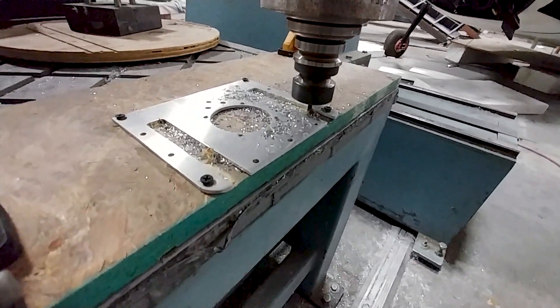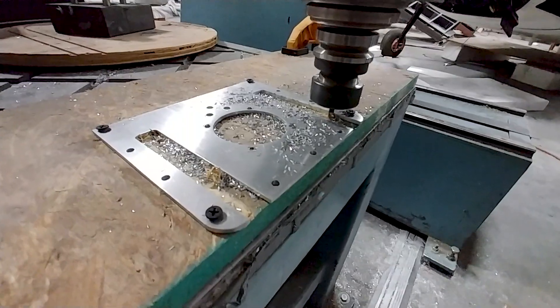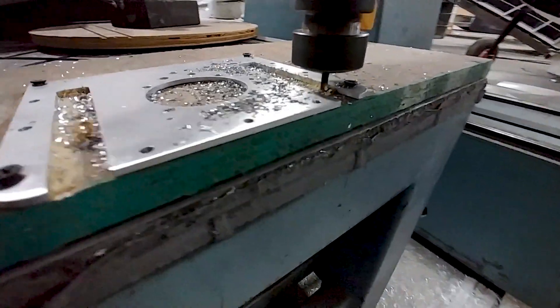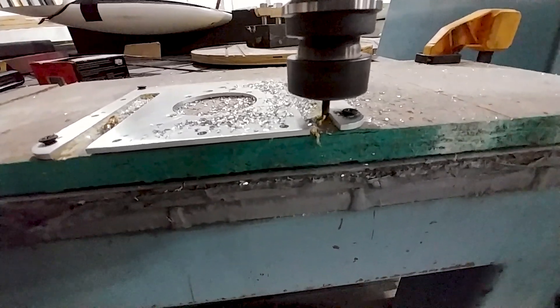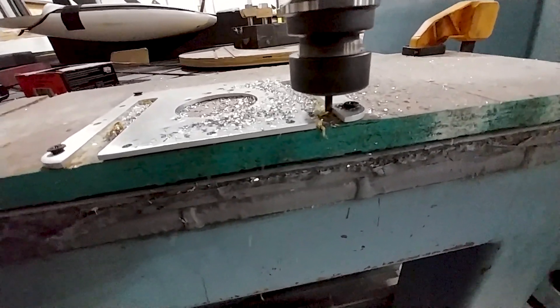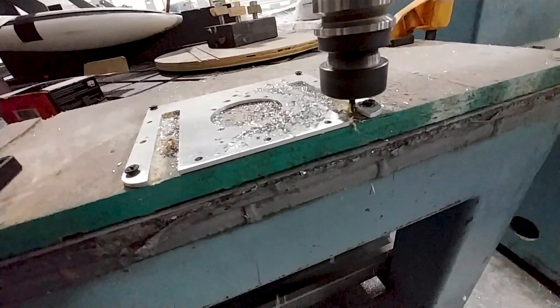Welcome back. Starting out the week, I attended to some problems that surfaced on Friday. The first was not enough clearance on either side of this little cover plate for the throttle, so I had to make those a little bit wider. The easiest way to do a nice job was with the machine, just running it by hand through there, manually stepping along - but got that done so it fits nicely now.